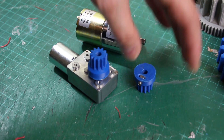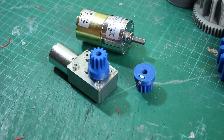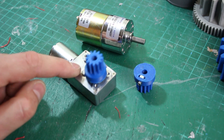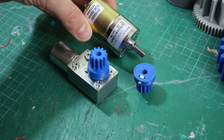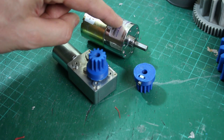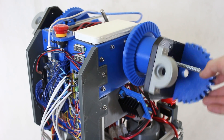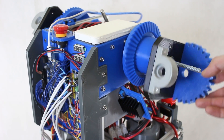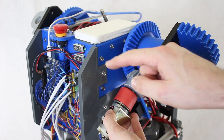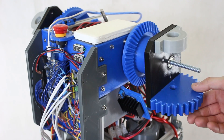My pinion has a captive nut and a grub screw to hold it on the flat of the shaft, similar to a 3D printer extruder gear. I've got two motor options here: 100 RPM motors used in my Gonk Droid's legs, and another 100 RPM version with a much bigger motor body. However, these are driven by a worm gear and those by spur gears. I can stop the worm-gear one with my hand, but I can't stop the spur-gear one, so I think I'll be using those. The motors that turn the bevel gears are much bigger anyway, so they're fine with a massive gear - I just need to make a motor mount.